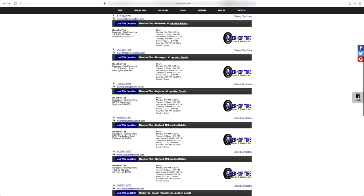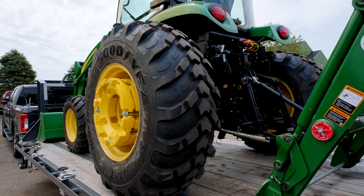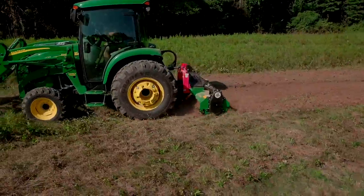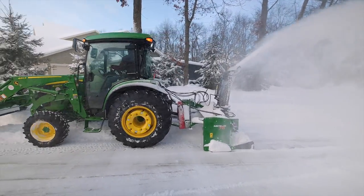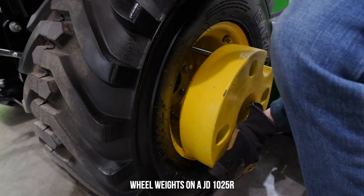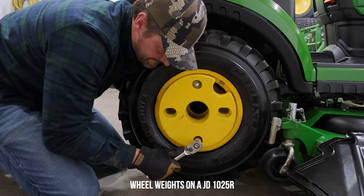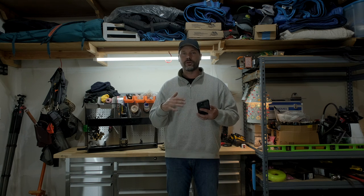Sticking with wheels and tires, wheel weights are a really good option. On my 4720 — previously the 4066R — not only did we have liquid ballast inside the tires, but we had a triple stack of wheel weights right inside those wheels as well, giving about 600 pounds of ballast weight right there. This is all weight on the rear axle, helping keep your back end planted to the ground so when you have a heavy load with the front end loader — whether in your bucket, on pallet forks, or in a grapple — you want those rear tires planted for safety and efficiency. On larger tractors like the John Deere 3R and 4R, you can put on triple stacks of wheel weights.